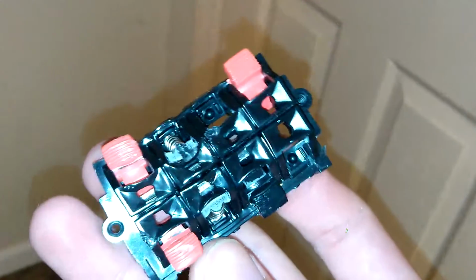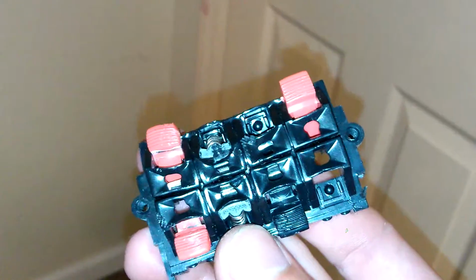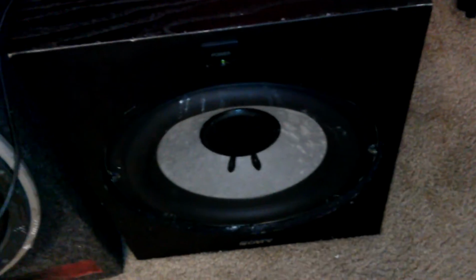If it will focus, there we go. You guys can see that got quite hot. So someone shorted these out, and that's why they got rid of it. They wound up cutting the power cable, and that's what happened, I guess, when you short that out. So yeah, it's trash. You can't obviously use those anymore, but if I find another one, it has to be an 8-prong or 8-terminal for speakers. I can just resolder that back onto the board and then pretty much have a complete unit again, even though I really don't care to do that, but I could if I wanted to.